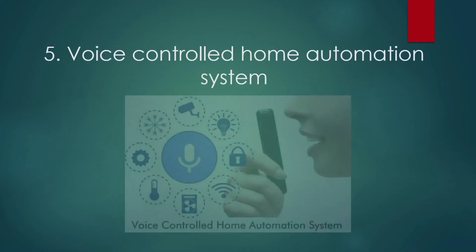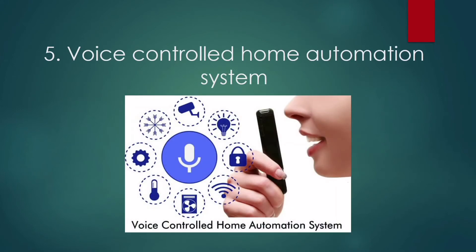Next is Voice Controlled Home Automation System. In this IoT project you can control your home AC appliances using your voice through an Android app. We make the ESP's IP address publicly available, build a junction box to toggle the loads, and install a mobile application that recognizes speech and communicates the information to an IFTTT applet, which controls the loads through the Maker Webhooks.